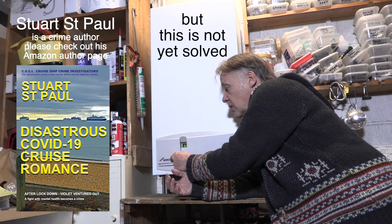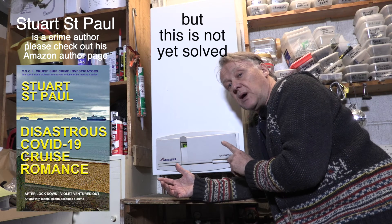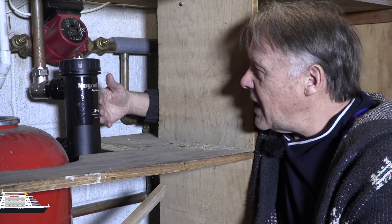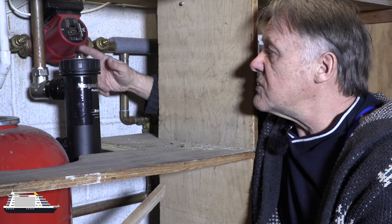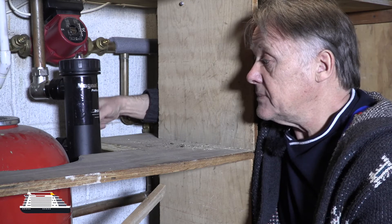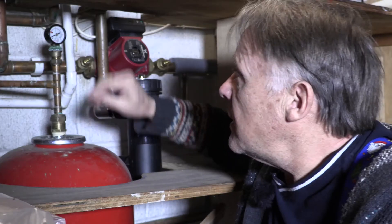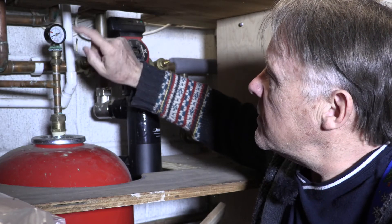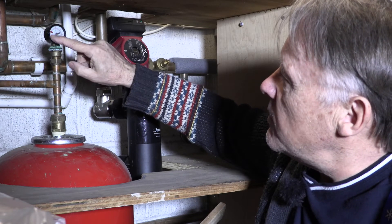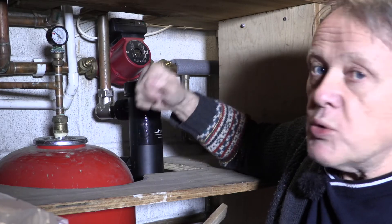This section is just a static piece of plumbing — unlikely to go wrong, but it should be cleaned out at each service. Make sure you get a plumber who knows how to service it. It's basically a water tank — these do sometimes cause problems but usually only after a good few years. We found a problem with the valve at the top: water pressure should be up to the red line marked by the plumber, and it's too low, so we're going to put some water in the tank.